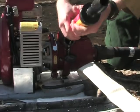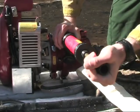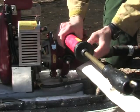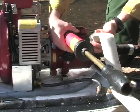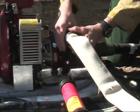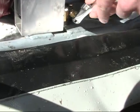Now we're just going to prime the pump head — make sure it's good to go. It's already got water to it. You want to stroke this until water comes squirting out of the handle area. That should be good to go. As quick as possible, you want to uncouple this and couple your hose lid. Now this is a pressure fitting — it doesn't have to be gorilla tight. Hand tight will work. Now I'm just going to verify that the fuel line connection at the block is good and tight.